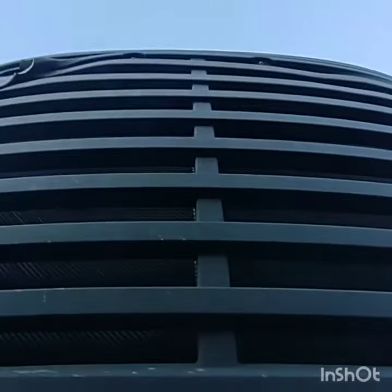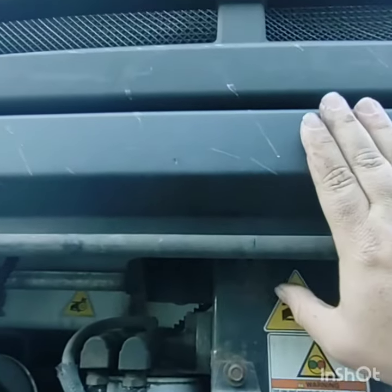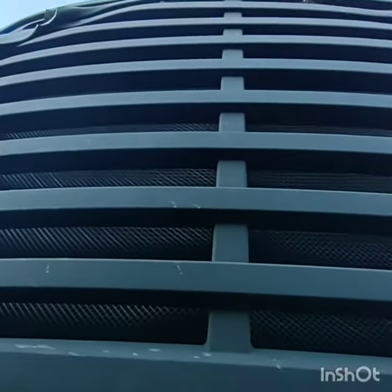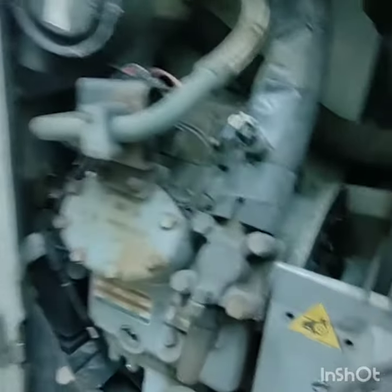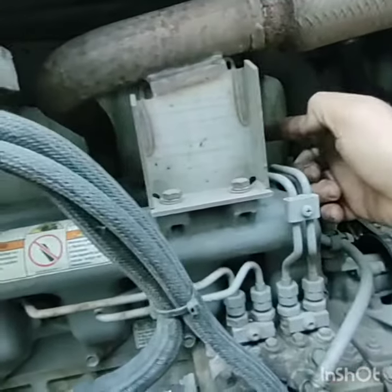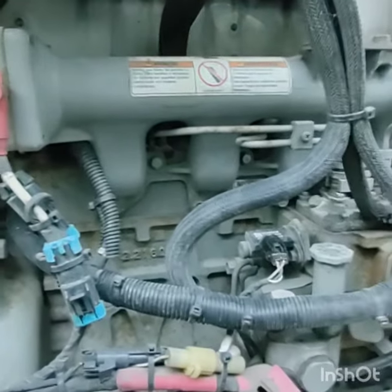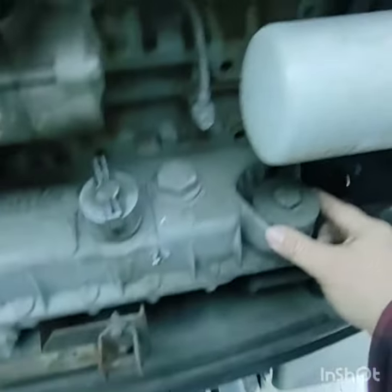In the upper unit here we got our condenser. On the Carriers this does not open. On the Thermo Kings this will open, and you can look up in there — on the Thermo Kings your coolant tank is most likely way up in the center. Different Thermo King models and configurations are going to be different. These Carriers can develop over time a tick in them, like an exhaust tick. What has to be done is the unit has to be pulled from the trailer — it's around the back side of the engine. I've replaced two of them, got them done for about a thousand bucks — really not too bad. You got different rubber mounts here for the compressor and for the engine. Everything in here looks pretty good.